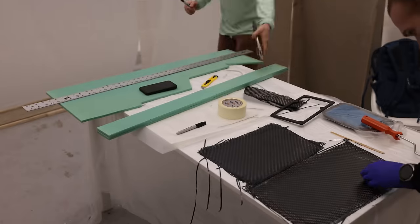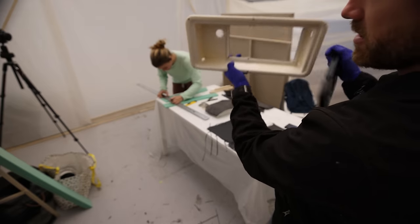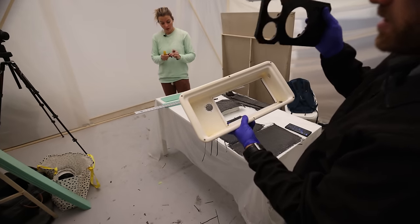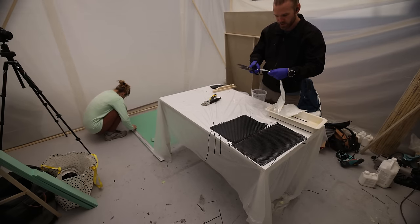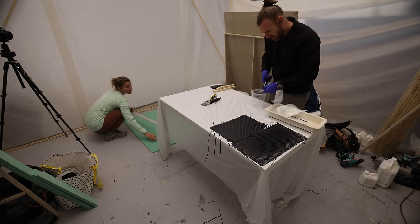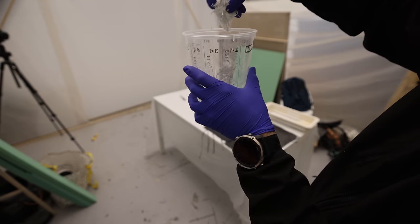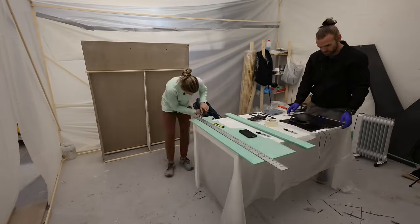This is the engine control — the instrument panel sits in here with all the engine instruments, and you can see it's all sort of cracked, sun damaged and rotted all over the place. We're trying to figure out how to repair it. This other piece is also cracked but we've kind of salvaged it — it would be hard to replace because it has all the mounting for the actual instruments. I'm just going to chop up some of this scrap fiberglass to make chopped strand, so I can make essentially thickened epoxy with little shards of glass in it to fill the cracks. Don't breathe it.